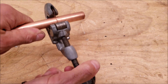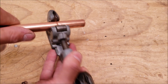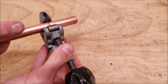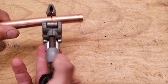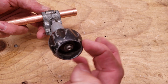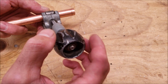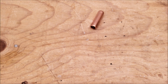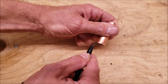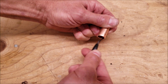First I want to go over what happens after you cut a copper tube. It's going to be very sharp on the end, it's going to be indented inwards, and we need to go ahead and ream that. I'm going to show you the different reaming tools. We spin the tube cutter around once, turn the wheel about a quarter turn, then go around again. Every one to two turns you keep edging the wheel in until the copper tube ends up falling off. Once we have this done, you can see it's very sharp on the end. I'm first going to use my stick reamer — it just cuts right along the inside and this tool works very well.